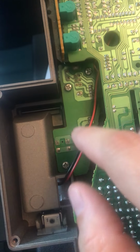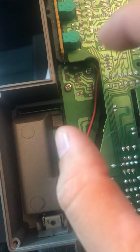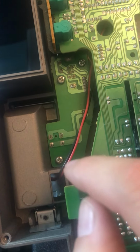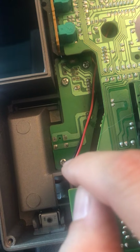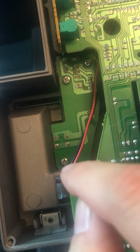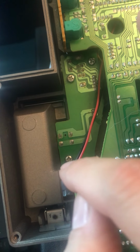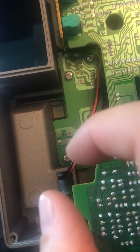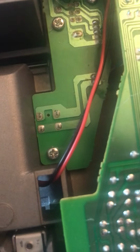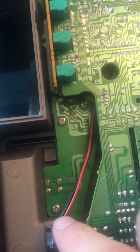It's the same thing. Otherwise, if you torque this screw down, you might find that the board doesn't match up right. Then you're going to have to try to move it. You're going to be putting a lot of pressure on this corner of the board, and this screw is set in a fairly good amount. But if this were mounted a little bit further out, if this hole were drilled a little bit closer to the edge of the board, that could crack right off. You don't want to do that. You also don't want to tighten it enough to where the board's going to crack. So that's another important thing.